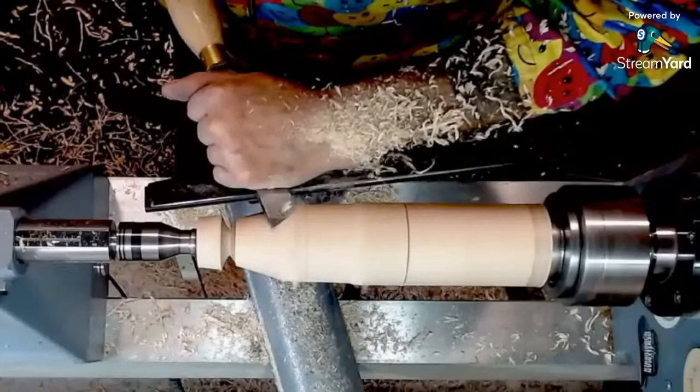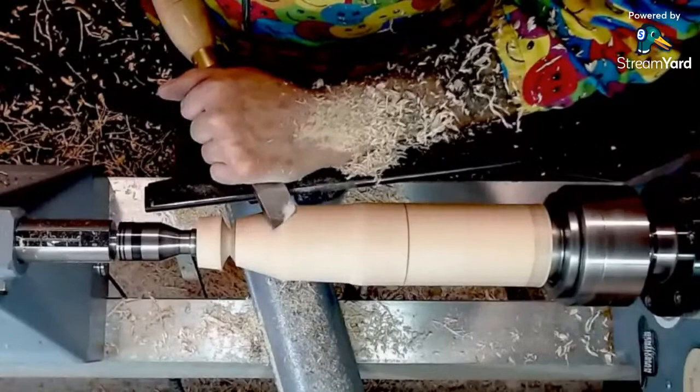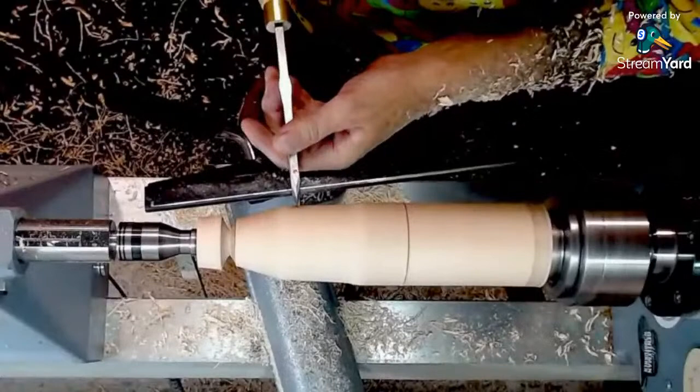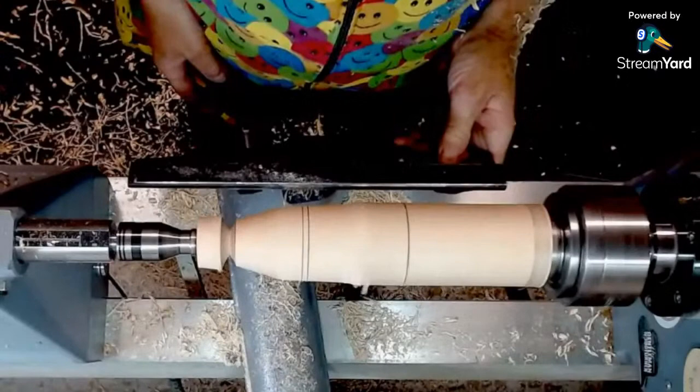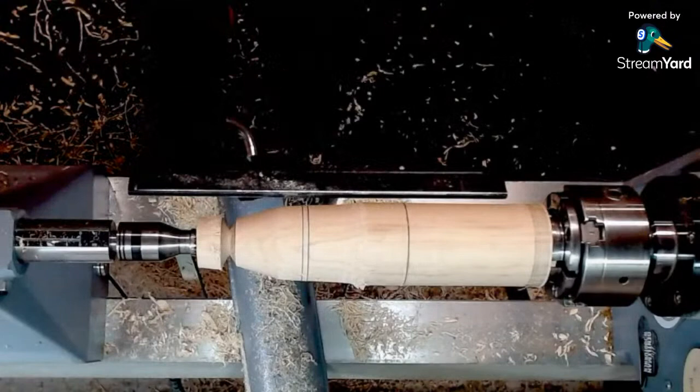Come out of that. Rub the bevel, pick up the cut. Take your time. Thing is, you're starting it with a bevel not there because you've got an end and you want to come the other way. I showed you that. It's for small pieces that you can do that with. There we go. Right, now what I would do next is I would cut the top half of my brim. All right. With a V cut down towards the brim. So you get to the right depth, then you know what you've got to take off.